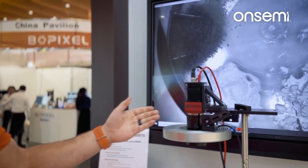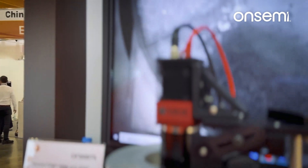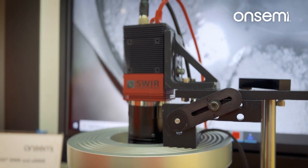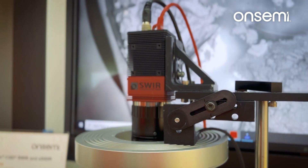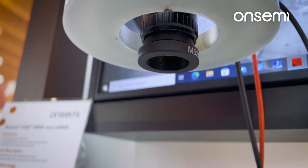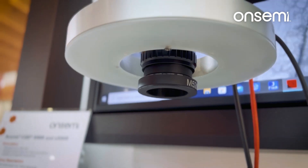We're here happily showcasing our CQD Sphere products. If we zoom in over here, we have our 1920x1080 15 micron pixel pitch Sphere camera, sensitive from 400 to 1700 nanometers. In this demo setup, we have a 1550 nanometer ring light LED, as well as a 50 millimeter Machine Vision Sphere optimized lens and 1550 bandpass filter.